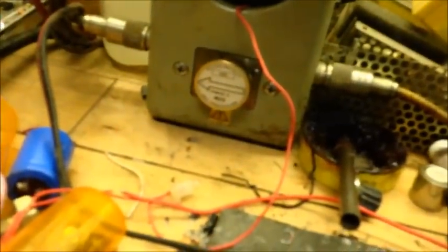Let's see where we're at. Still with the 50 watt slug in there. What do we got? So we're on the center scale, so about 2 watt dead key is where it's sitting at right now. Mic gain 12 o'clock. Oh yeah, 14 bird. So it's at 14 bird, and there's no lazy needle there either, like the last mod that was in it. I don't do an MPC mod myself per se. I got the camera right. But that's where it's at.